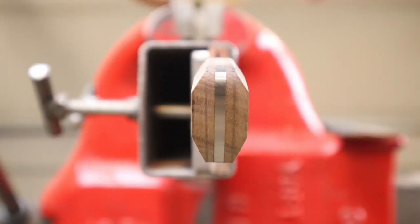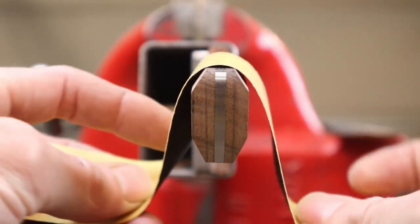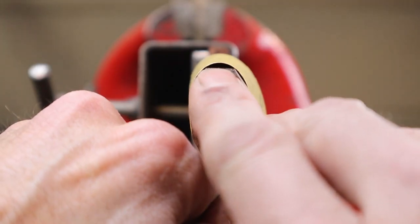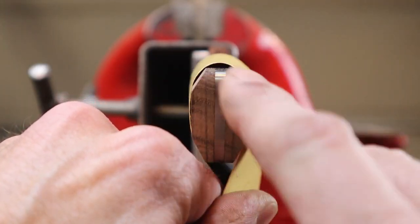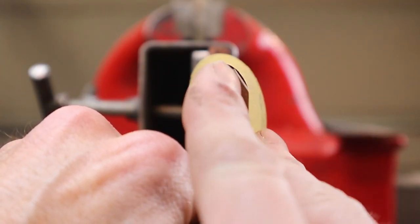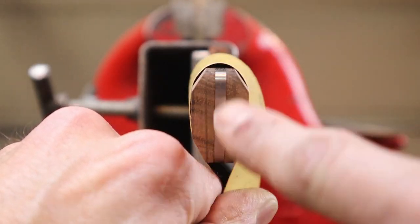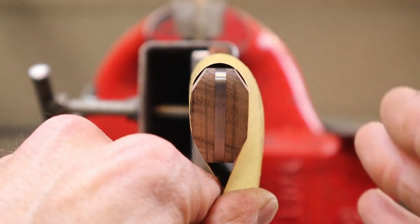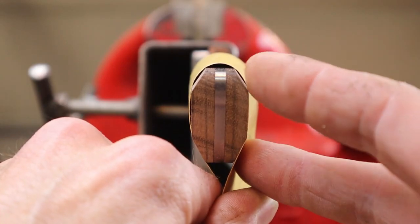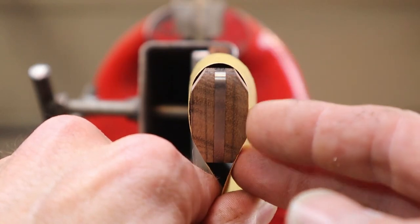With the shoe shine method, when you wrap your paper over the top, you'll notice there's a gap right here. You don't want to shoe shine to where your paper touches the metal, ever. So I stopped on my line right here on both sides, right there and right there, so you can see my line that I drew. When I shoe shine, I'm removing material from this side right here. All I'm trying to do is round from my line down.